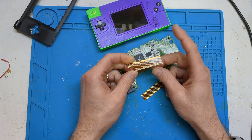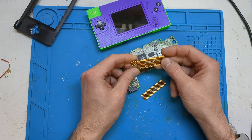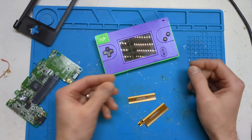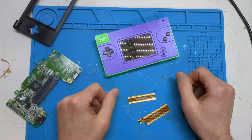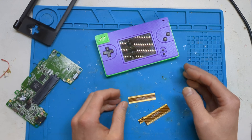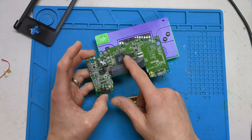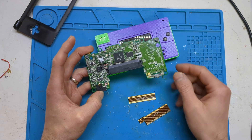OSHPark makes quite cheap flex PCBs, though they do take a while — normally about a month to get to England. It was great once I got the prototype back and it worked, so I made a better board. As usual, there's a blog post in the description with all the files and a write-up. I'm not going to do a full tutorial because if you know, you know — you basically remove the GBA port, move the DS port, remove the crystal, move the battery post, and it's pretty self-explanatory.